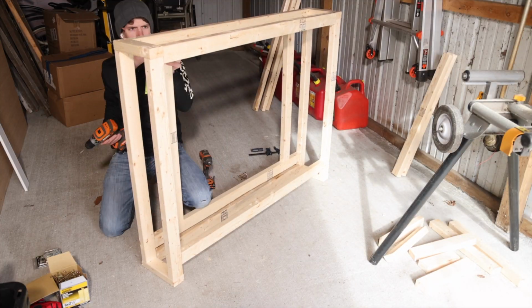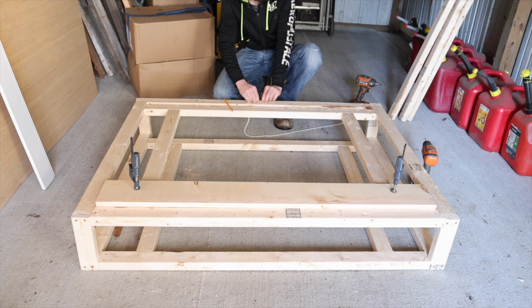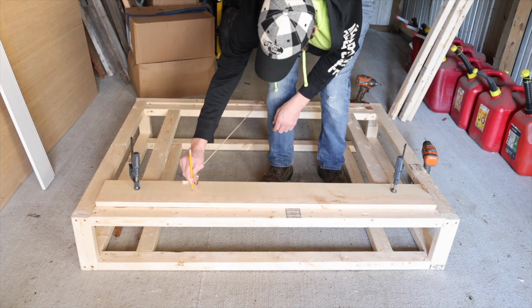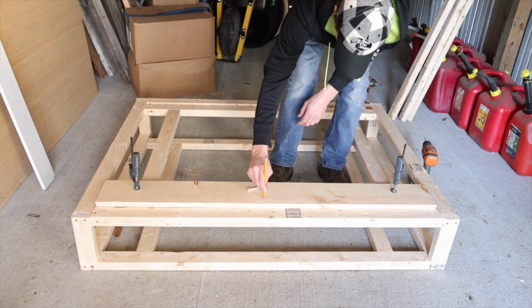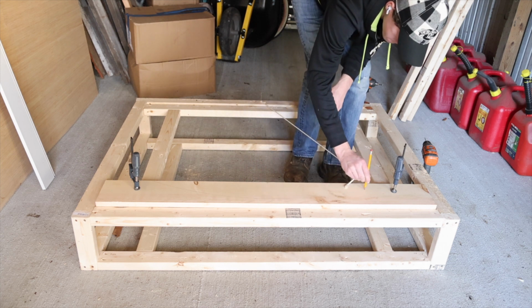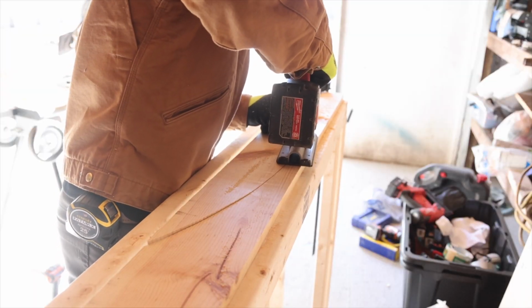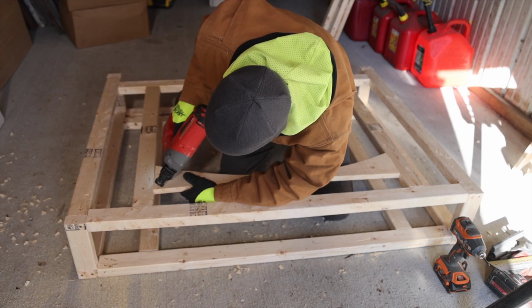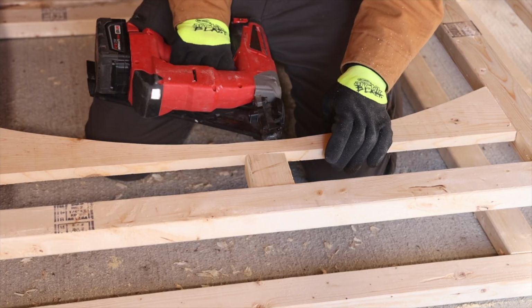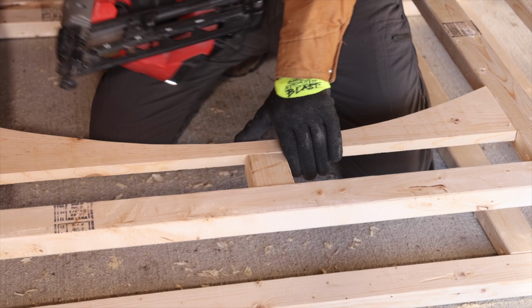Once all this framing was finished up, I needed to create an arched top for the inset area. I accomplished that by simply using a screw with some string on it and attaching that to a pencil, placing the board around where it was going to end up, making the mark, and then cutting out two pieces with this arch. I had about an inch or so of material left in the middle, so I added a 2x just for reinforcement to keep that straight across.